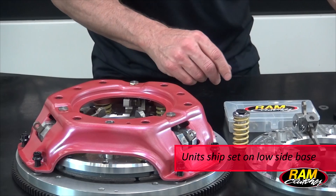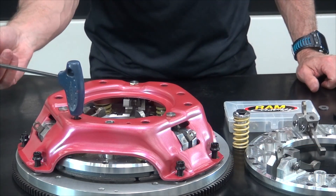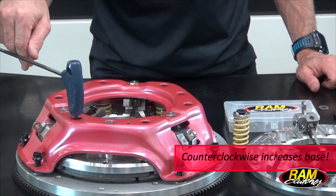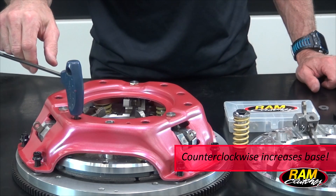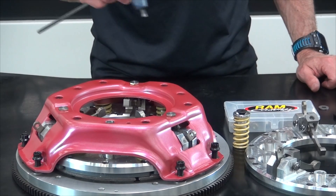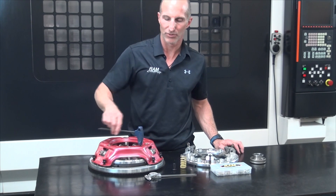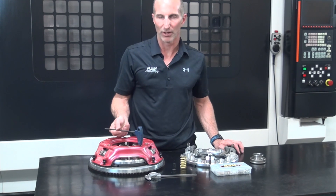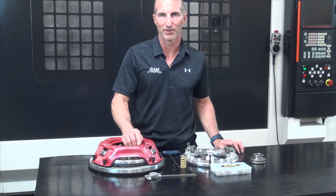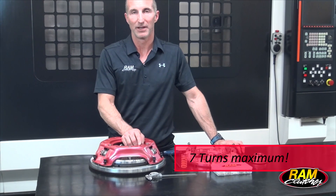Making that adjustment, you put your Allen wrench in place, turn it to feel a little bit of tension on the cover, and then you can start to count the turns — one, two, etc. — to your desired pressure. If you're unsure how many turns of spring pressure to use, put the Allen key in place and slowly turn the screw clockwise until you feel the adjuster break away from the cover. Be careful: the adjuster will adjust to about seven turns of pressure, but do not go beyond five — that'll keep you from unscrewing the adjuster from itself.